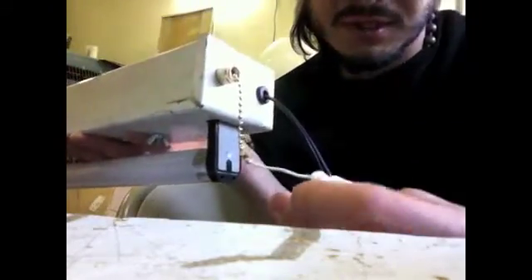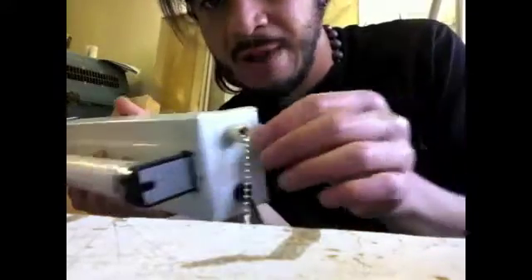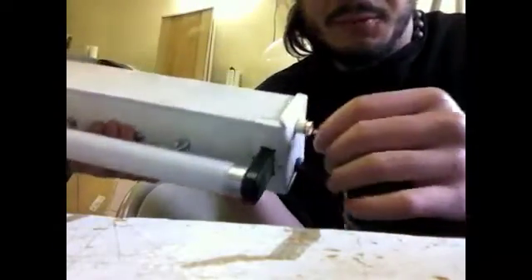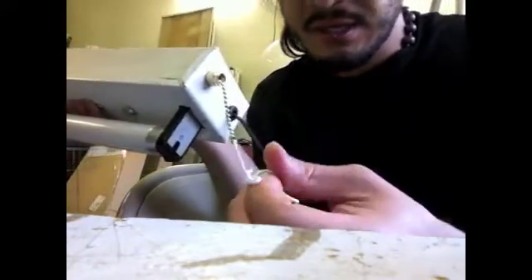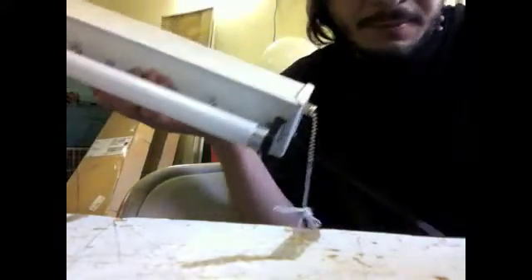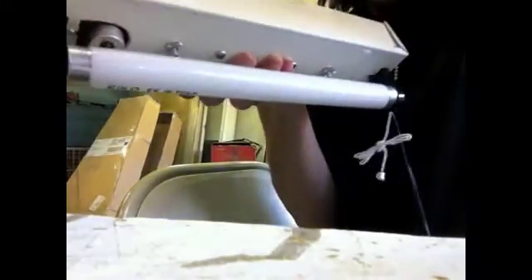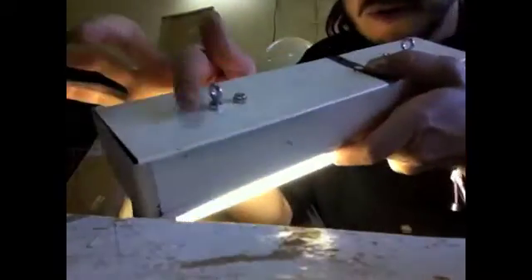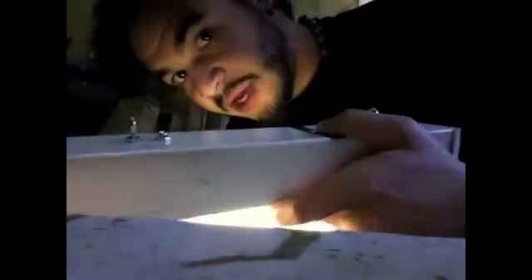On the other end there's a pull chain switch and a cord. I had to drill the holes, and I had a scare there because the drill press grabbed and flung the ballast cover while the lamp holders were still in it — I was very lucky that nothing broke. But we eventually got this done, and this is the typical cloth extension that comes with these pull chain switches. It can be lengthened by pulling on the ends of the bow. And of course there are hooks in the back, which are removable, and the screws which hold on the ballast cover had to be propped up with some nuts so that the little screw pegs didn't go too deep.